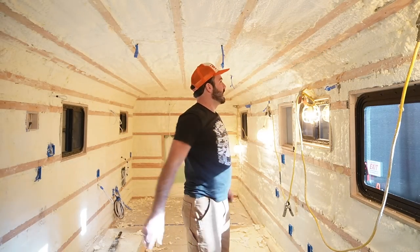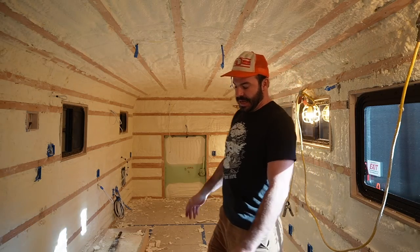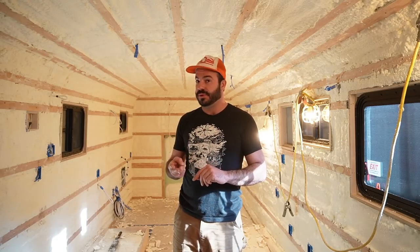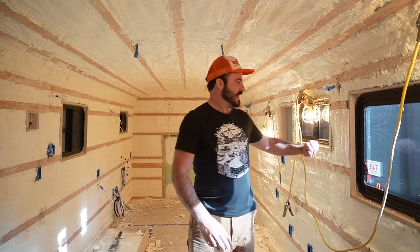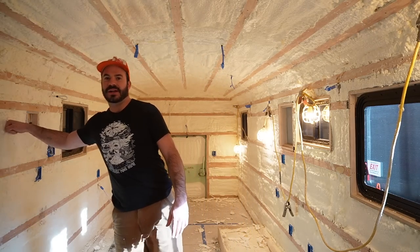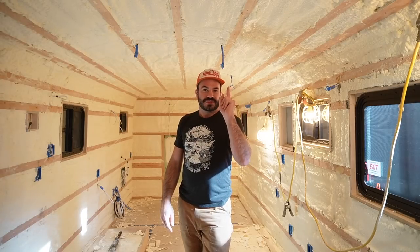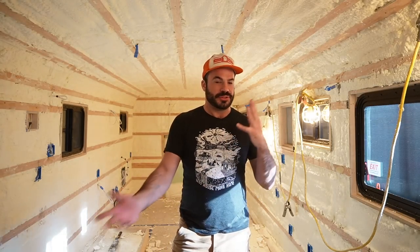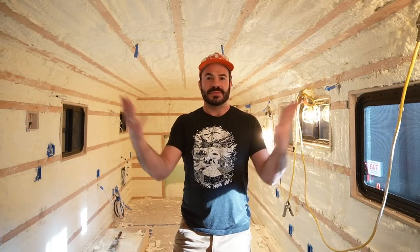I've spent a lot of time scraping and trimming this bus — I'm still not done yet, but I wanted to wrap things up and show you what the almost-finished product looks like and reiterate what I love most about spray foam: you get the vapor barrier built in, the highest R-value per inch, and the structural addition of basically encasing your entire build in foam. All the strapping in these walls is solid as a rock. I hope this video is useful and helps you get the most bang for your buck out of your spray foam job. Put any tips or tricks in the comments below — that's what we're here for. My name is Chuck Cassie. Thank you for watching. We'll see you next week.